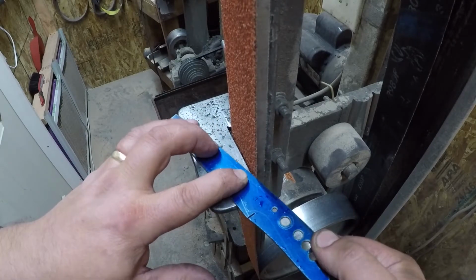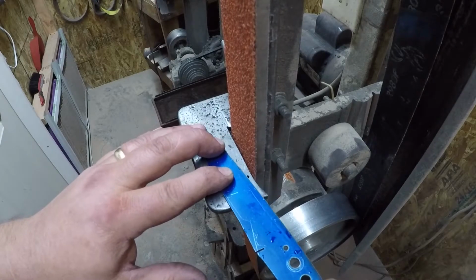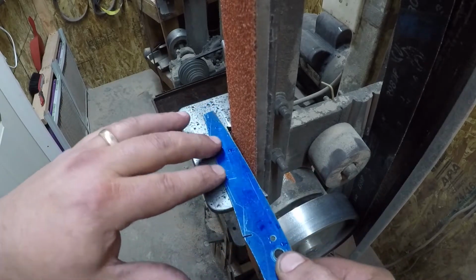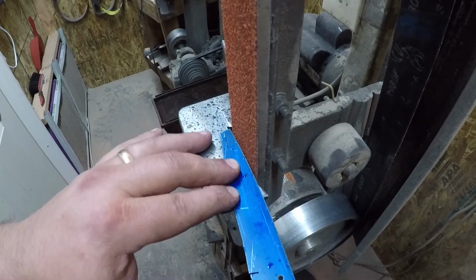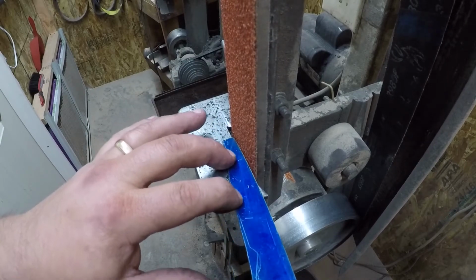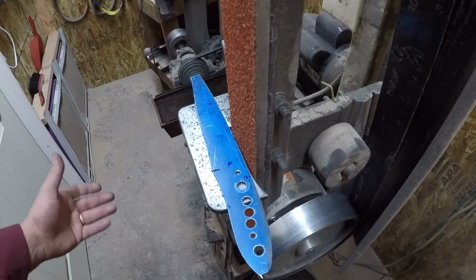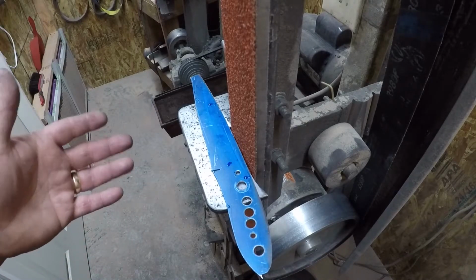The other thing when it pertains to grinding is that burr will sometimes, you see that little hitch right there as it comes off that table? That burr is grabbing the table, okay? So if you've got your table set really, really close to your belt, or if as you're coming across you feel some grabs, it's not coming smooth, it's that burr grabbing the inside of your belt, okay? It's enough of a difference to make a difference sometimes when you're grinding.